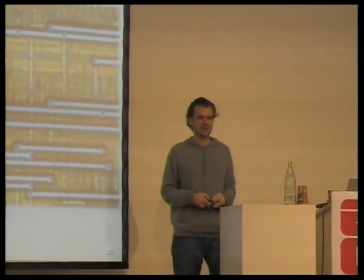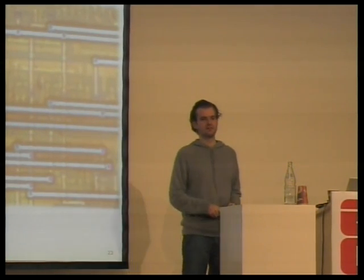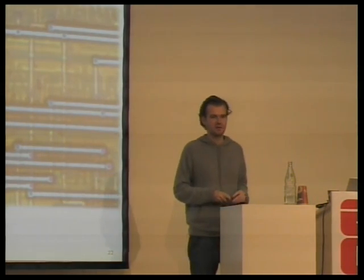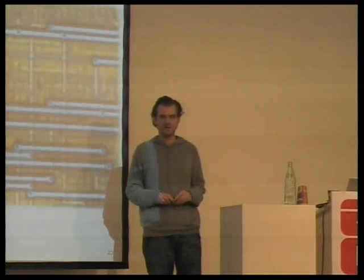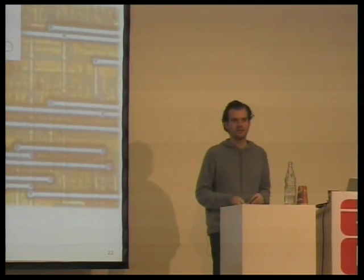Hello. So what would you do to secure the chip? Good question. Let me cite Chris Tarnowski here, who has been breaking microchips for at least 15 years. He says everything helps, but nothing is perfect. So try to be a moving target, try to have as many different security types in your chip as possible, and keep replacing them. There's this company NDS, they make satellite smart cards and sell them kind of expensively. Every batch of their chips, from what I understand, is somewhat different from the batch before. So they never manufacture many chips of the same type and just keep moving, so nobody has a huge incentive to break them, because you can only ever break a small number of chips. That's probably the best advice I can give, but nothing is perfect.